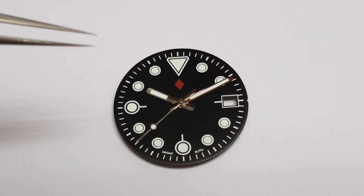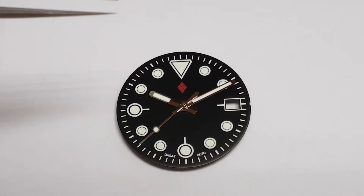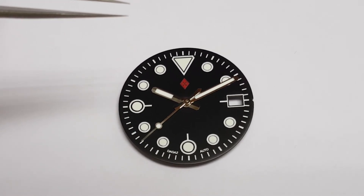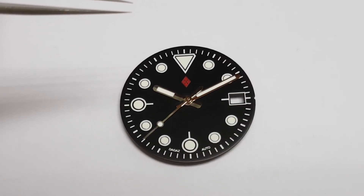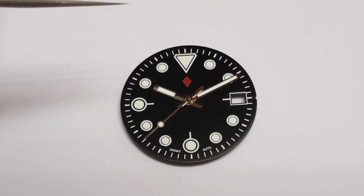These are made of diamond cut electroplated brass. And the luminous material is Genuine SuperLuminova in our blend of 95% C1 and 5% C3 for added brightness. These are made to match our premium quality dials. They use the same proprietary blend and they're also undercoated to reflect the glow from the bottom upwards, which makes the glow a little bit brighter and a little bit longer.